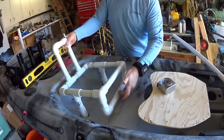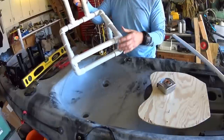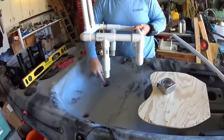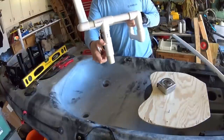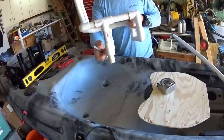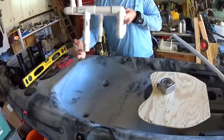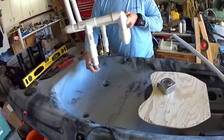So I made the square up front, had the three-way tee — got these at Lowe's, real nice for these corners. When I figured out the depth, that three-quarter inch difference between these two, I came down here to my scupper hole and the one inch fits in real nice. This is just a one inch slip-slip coupler — that means the PVC slides into either end of this coupler. And I figured out how deep I wanted to go into the scupper holes so that the seat wouldn't move, and then how deep the PVC would come into the coupler, and that's when I made my cuts.